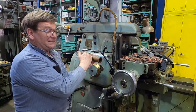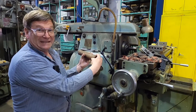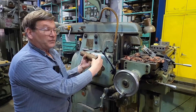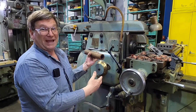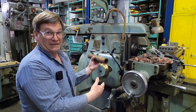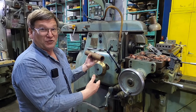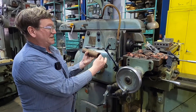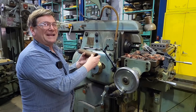If the spindle got bent, then we will know over time because this bearing will no longer be in line where it should be, and it will wear quickly and we'll have trouble. We've been using the machine — it's working fine. So it will be a matter of long term before we know whether there was actual bearing damage from the crash or not. But since that's such a major repair, we decided it's just squished material or a minor bend.